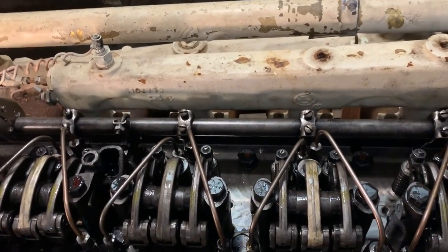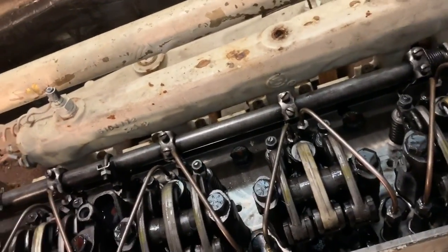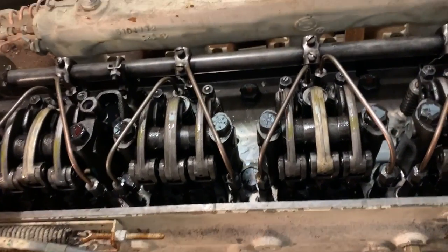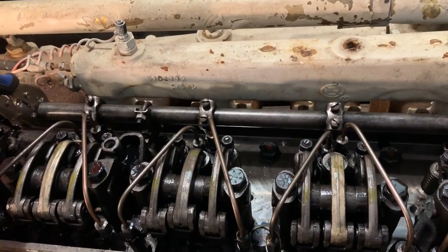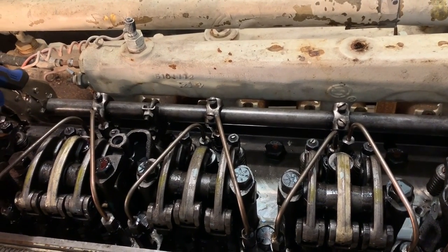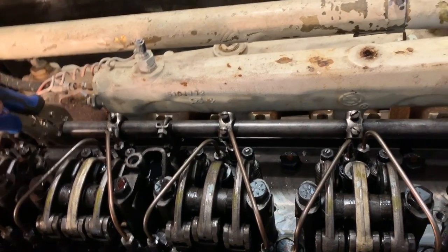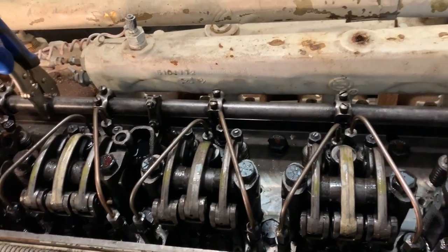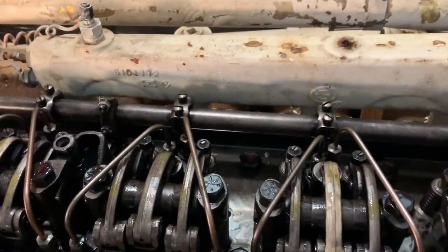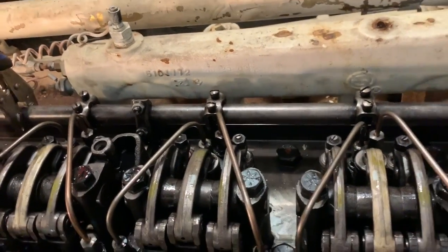I turned it back off. It was racing a little fast for what I wanted there. I don't like that at all. Stop! Don't do it anymore. Okay, don't do it anymore. Oh. Not a problem? No, the governor spring is probably stuck. It didn't bring it back down to an idle. It was going much, much faster RPM than it should have been. So yeah, don't touch that again for a little while.